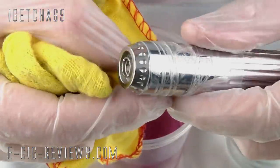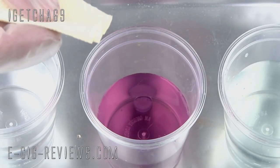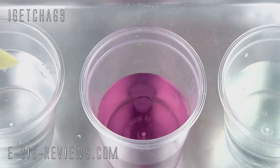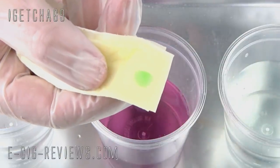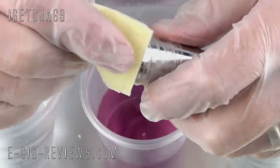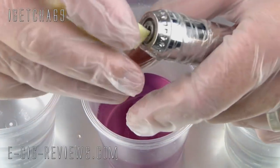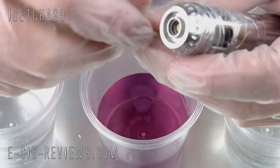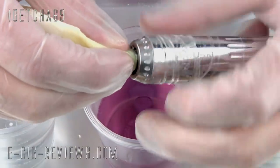The better the surface, the better the gold plate will come out. Get some fairy liquid or washing up liquid and dab your tissue into distilled water, add a little drop of the fairy liquid, then use this to work onto the metal you're going to be plating. This basically helps remove any grease or dirt, as either will affect the finish of the plating. Make sure you get the outside but also the juice well and the atomizer connection.